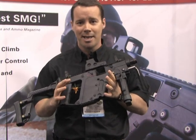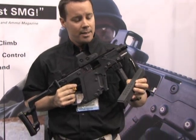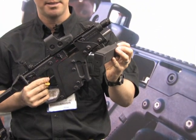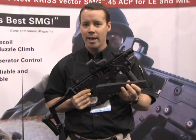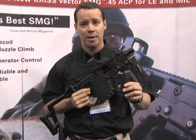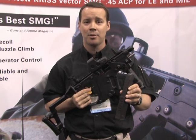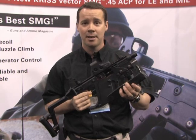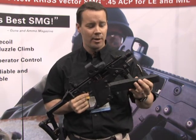We worked with Magpul Industries out of Colorado and devised a sleeve system. You take the base plate off the Glock, slide the Glock magazine up through this sleeve — which adds an additional 17 rounds — put the base plate on the bottom of the extension, and we supply you with a different spring. Using the same follower, you now have a 30-round magazine that works with your KRISS but also with your Glock. We tried every high-cap mag out there with a Glock-type configuration, but running this submachine gun at about a thousand rounds a minute with a 30-stick of 230-grain caused harmonics that disrupted feeding, chambering, and extracting. So we had to make our own.